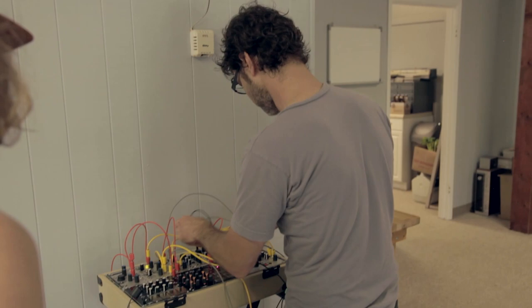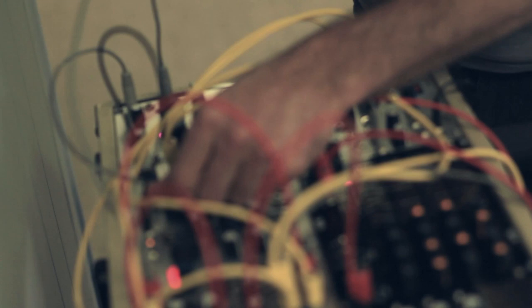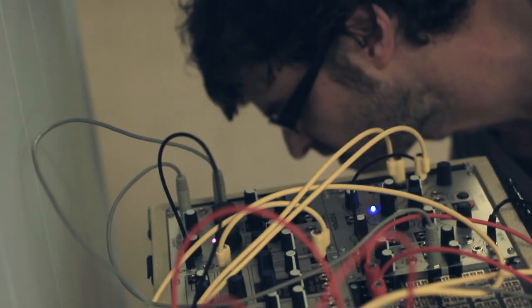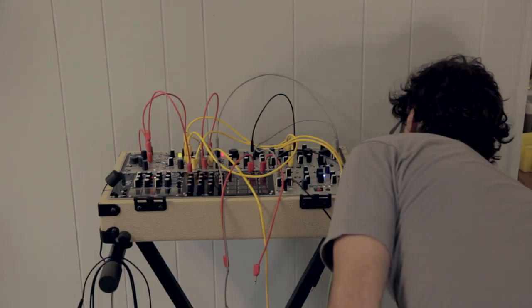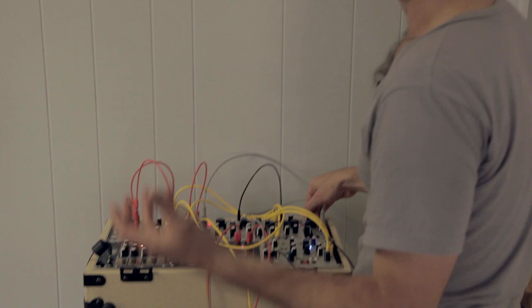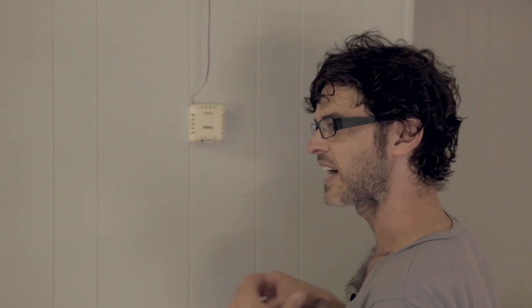Let's give it a whirl. Here's the pitch of the sine wave going into it, and then there's the shifted sound. You might notice something almost like amplitude modulation happening — that's part of the algorithm, because it's constantly fading between two different readback heads, and that's how it achieves the pitch shifting. If you like that, great. If you don't, you're kind of stuck with it, because it's always going to be there — it's part of the algorithm and it gives it its unique sound.